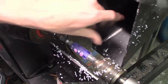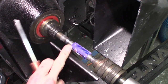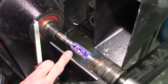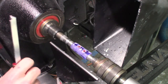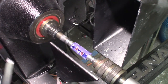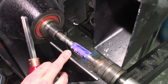I used to use filaments, and I kind of gave up on it because it just wasn't amazing, really. So I decided to try resin 3D printers, and I really like the resin better. I have an Elegoo Mars and an Elegoo Saturn printer, but I use the Elegoo ABS-like resin. That's literally what it's called. It's less brittle than the standard and even the water washable resin from Elegoo.